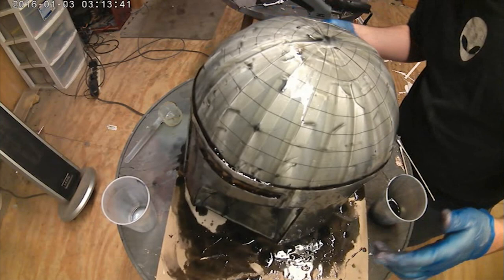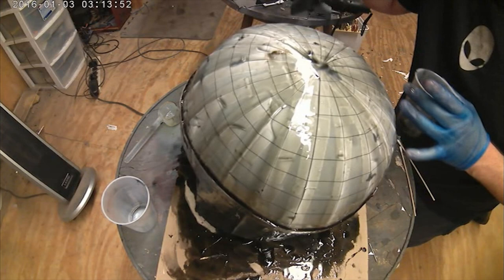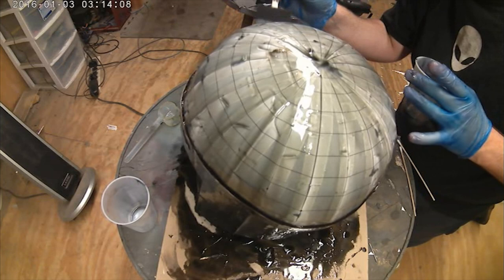The really good thing about epoxy resin is that for one thing, it is waterproof. It also is not a big deal with ultraviolet light, like sunlight isn't a big deal with epoxy resin. And it's just not as messy, and it doesn't have nearly as bad of an odor as polyester resin does. Polyester resin will run you out of a small space in a heartbeat.